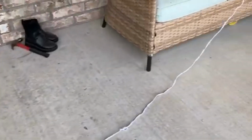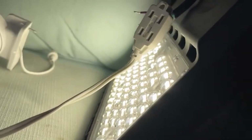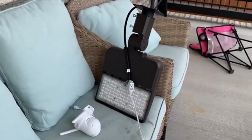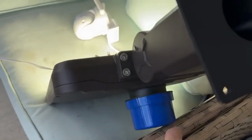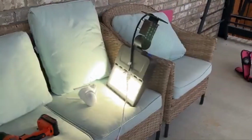I did the manual connection, and I'm just gonna show you how this photocell is working. Right now it is daytime, and let me go ahead and close that area. Now it's completely closed, and now it's on. I'm gonna get my hands off over there and wait. Since it's daylight, it's gonna be turned off by itself. Now it's off. When you close it, it's not gonna get the photocells, and it will turn on. That's why this is very important, and you can save energy and you can save money. After 15 seconds, it's just turning off.